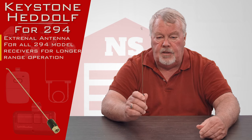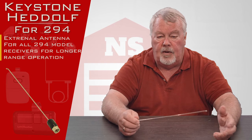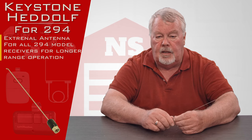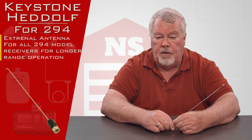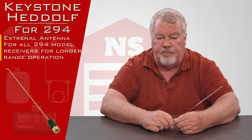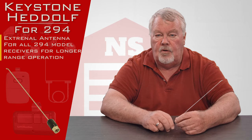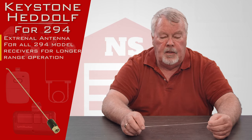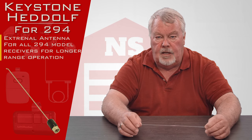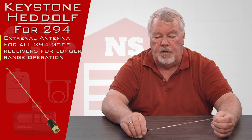If you want to get the antenna outside of the operator enclosure, you can drill a hole in it, take some coax antenna wire, and extend it — putting it up on a mast five feet, ten, or even twenty feet in the air. You can make the antenna go anywhere you want. In our industry, typically the higher the antenna, the longer the range for the radio control is going to be.